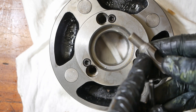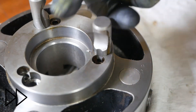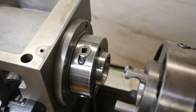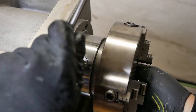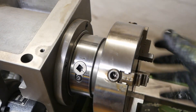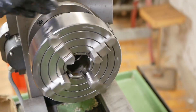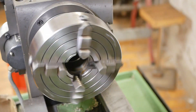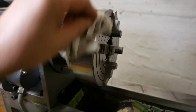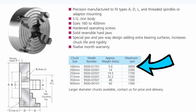These screws just lock the rotation of the cams. This is a 6-inch chuck so it's a nice size for this little Schaublin. This is a cast iron chuck so I will have to be careful not to exceed its max speed rating — but 3000 RPM is no problem at all.